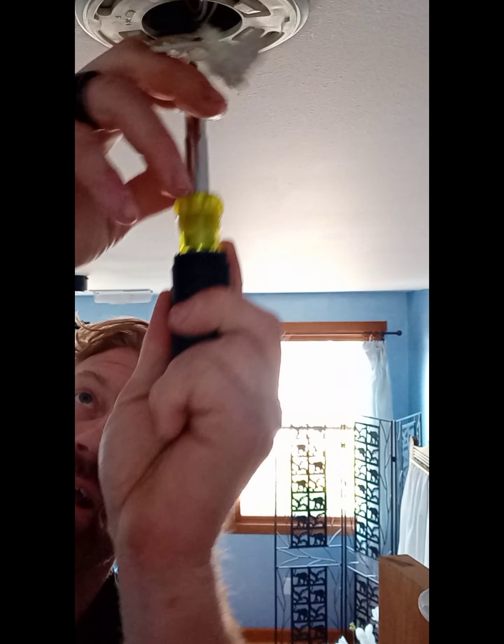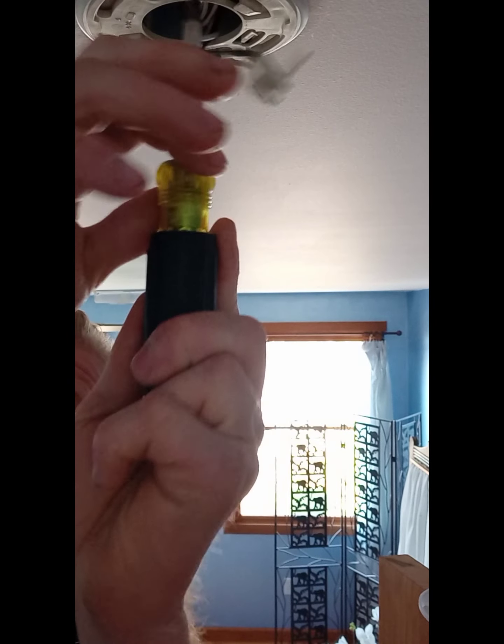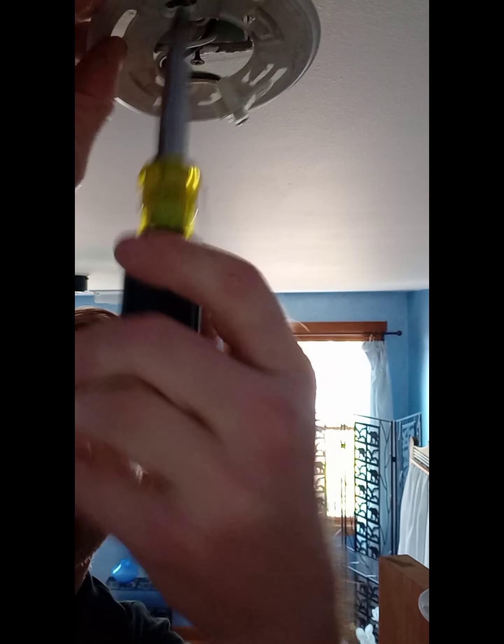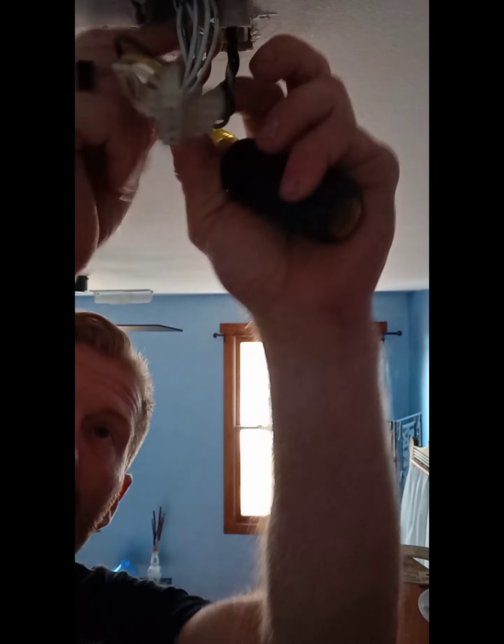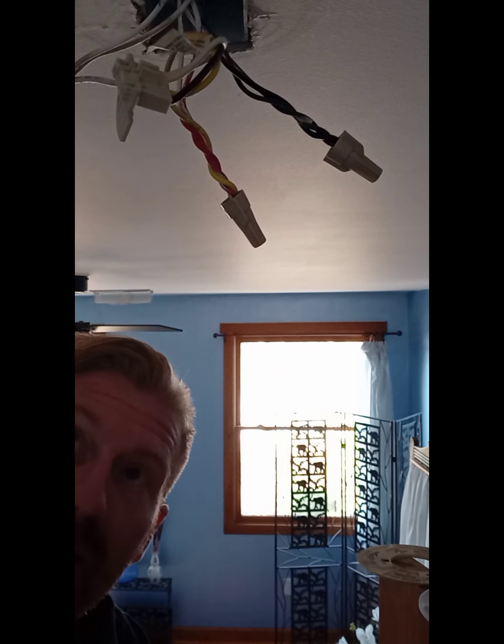The existing one will come with a tail and two screws holding up a plate. Just loosen those screws and slide the plate off. You'll pull the wiring piece out and find a white, a red, and a black wire tied to the same colors. Back in the day they had different colors, but the red going up into the ceiling is the one you're looking at.